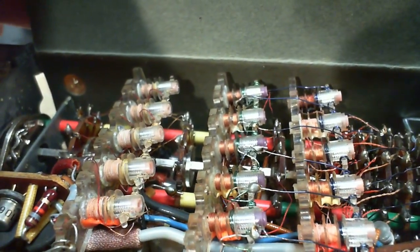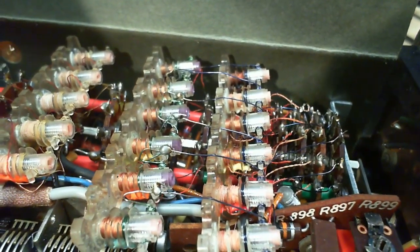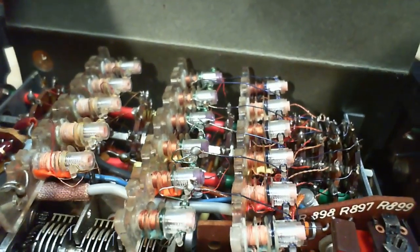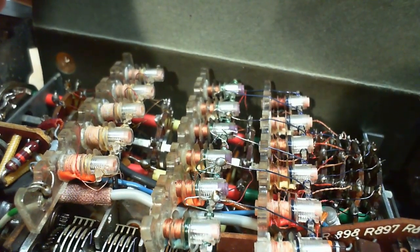Wow, you can actually just see the transformer. I mean, there's the windings right there, the slug going up and down inside the windings. Huh. Usually these things are in cans, but that's not true. This bank here, the two of them here, they're connected. See the blue wires running across? But this one's not. Seems isolated. So, wild guess, this is the oscillator.